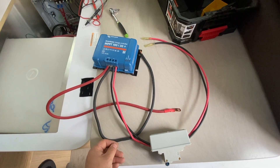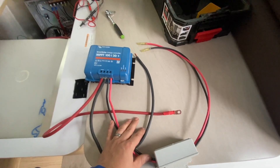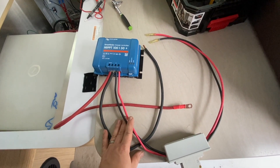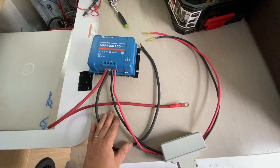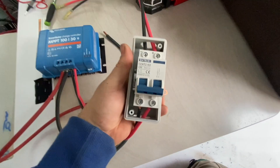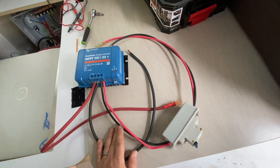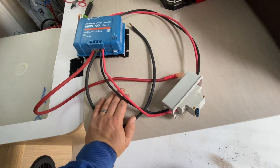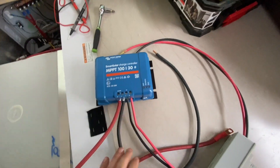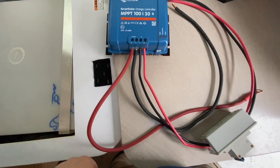I thought I'd go over exactly what I'm doing here. To make my life a little bit easier — and maybe yours too — I went ahead and pre-assembled this in the garage and then I'll put it in. My wire lengths might be a little bit off, but I erred on the side of a little bit longer, which generally leads to better maintenance. Solar is coming in here and I like to use red and black to keep positive and negative straight. Up on the roof I'm doing just all black, because with the MC4 connectors, as long as you do them one at a time, it's hard to screw that up too bad. This is a 30 amp controller and we're using six gauge wire, which is good to 50 amps normal load — some would say 80, and I fuse it at 80.